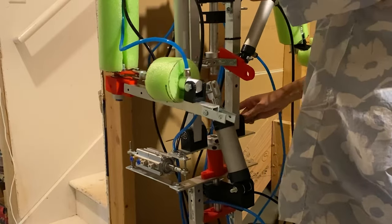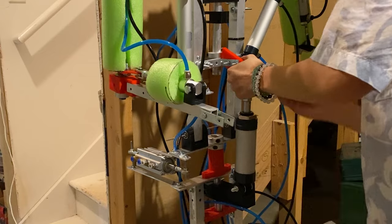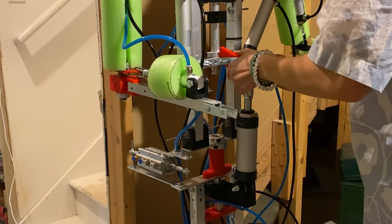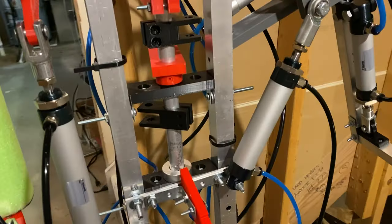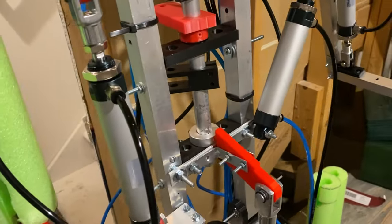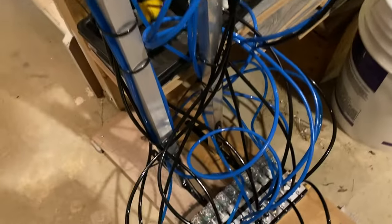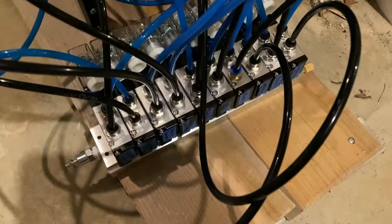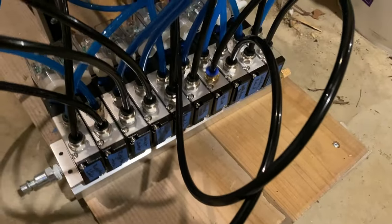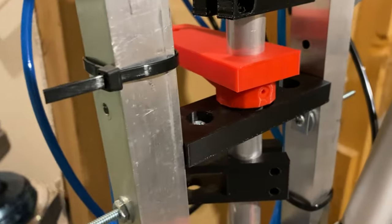The torso is very heavy - even heavier when the head is on here. There we go. Let me show you what was done tonight because I feel like I accomplished a lot. All of the airlines are connected - this entire valve bank down here has all airlines hooked up. I do need to eventually get another one of these that has like six of them so I can attach the remaining movements. Every cylinder on this character is hooked up to that. There are still cylinders missing - this needs to be longer so the head turn can work properly.